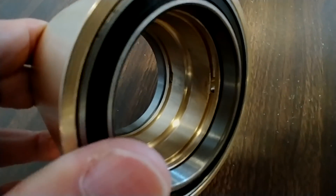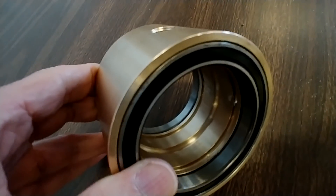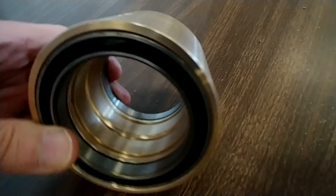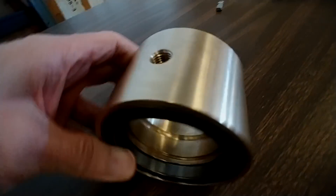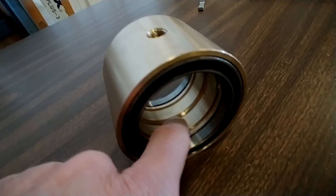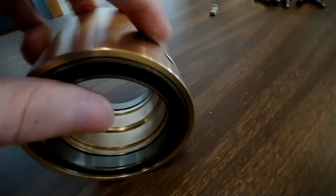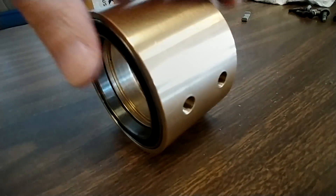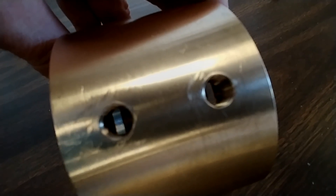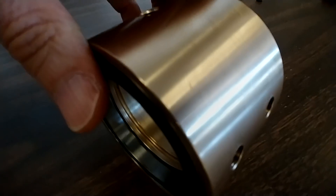Hopefully that's going to work out on the shaft the way it's supposed to. From a suggestion someone made on my YouTube channel, instead of having the drain holes out the bottom, I've got them clocked at 90 degrees. So the feed comes in here and it should always retain a little bit of oil in those channels. When it comes up to the halfway height it will drain out, and those drains are slotted because of the narrowness. If I have to block those off I can put little caps in there - the guys tapped those out for me as well.